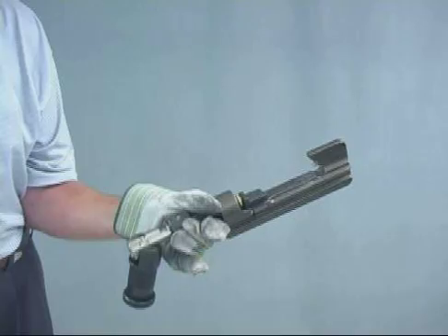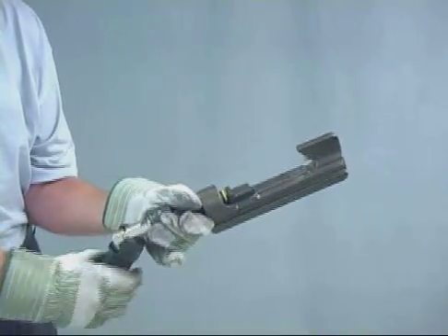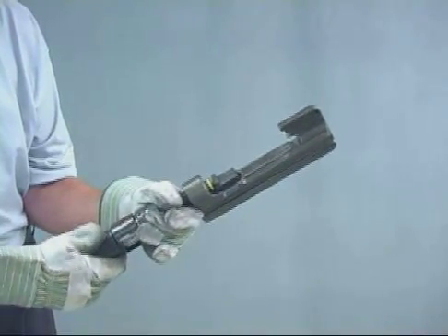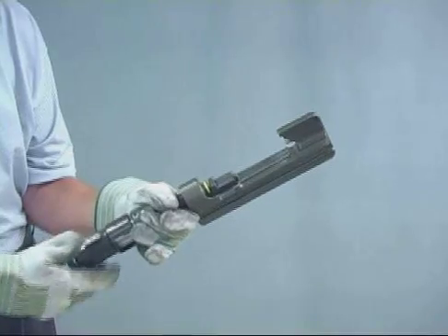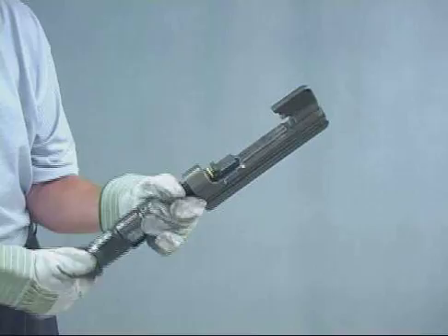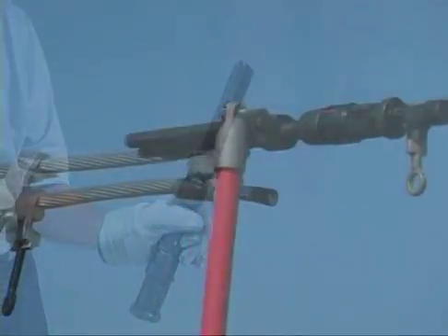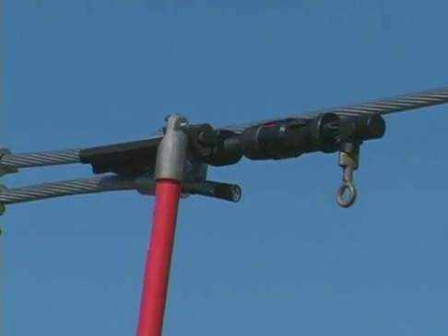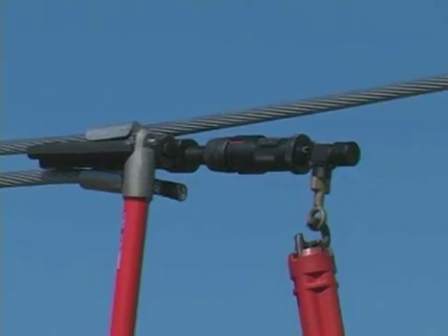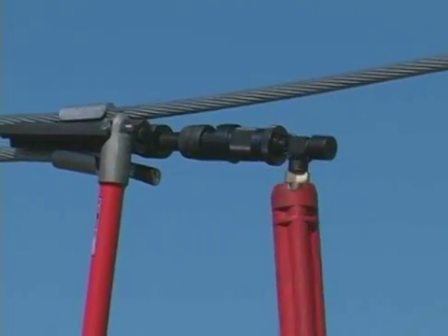We are using a blue-coated tap. The tool must be loaded before being positioned onto the tap. Loading procedures are the same as for the glove method outlined in Module 1 of this program. The tool is also positioned according to the same procedures as the glove method. Once the tool is in position, the assembly is made self-supporting by twisting the shotgun stick clockwise.